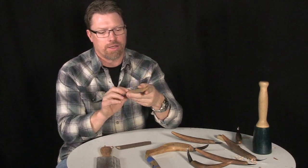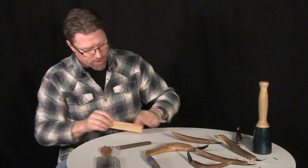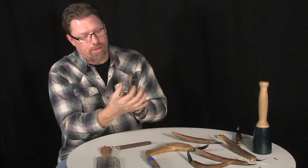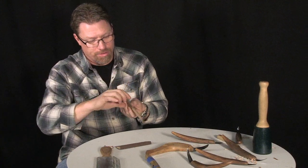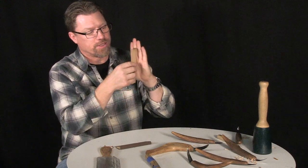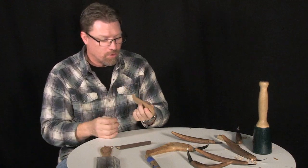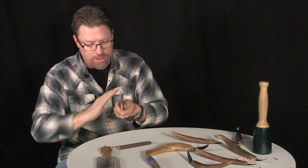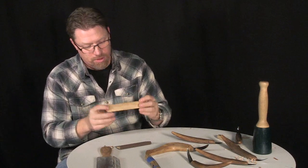He would take little pieces of wood, and he would run them through a table saw or bandsaw, and make them a little bit thicker on this side and a little bit thinner down here. And then he would take them either to a sanding belt and round them off, or I've seen him actually hand carve them round, and then you take some sandpaper and sand it smooth.